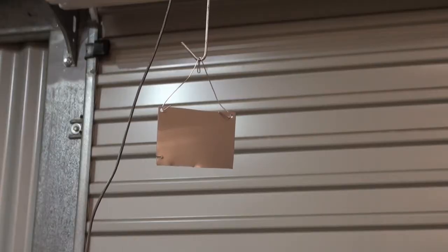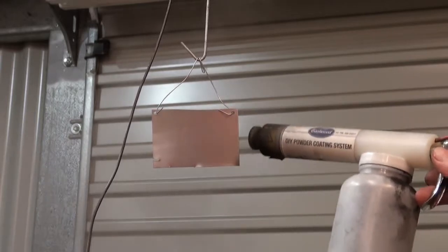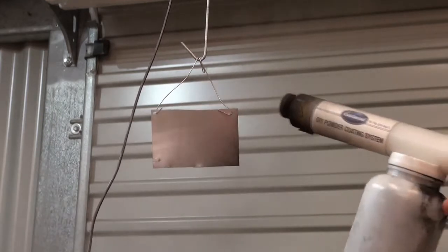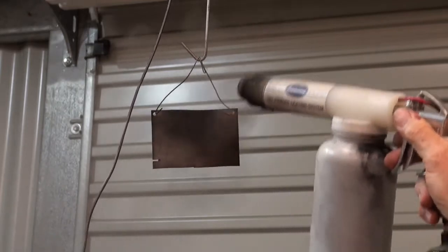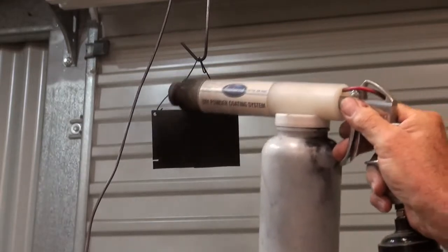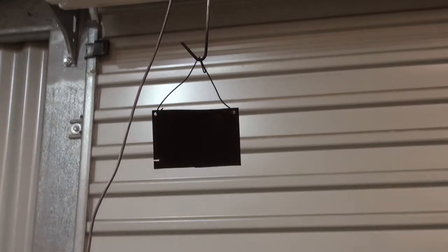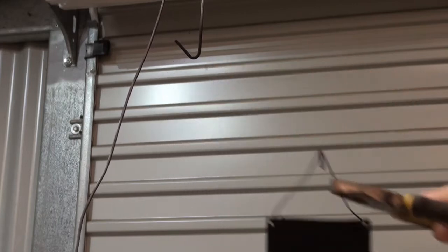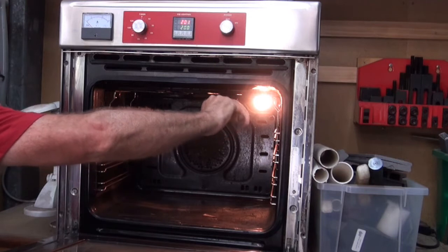The aluminium stock I'm using here is 0.8mm thick. It was cleaned with steel wool and some solvent — in my case I use methylated spirits. It's given one coat of super wet black gloss powder coat and baked in a domestic oven at 200 degrees C for about 15 minutes. The powder coating process is very quick and very simple, and it leaves you with a beautiful glossy coating. Once it's etched in the laser engraver it creates very crisp clear outlines.